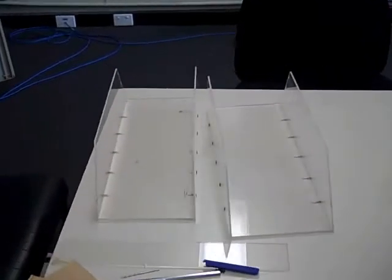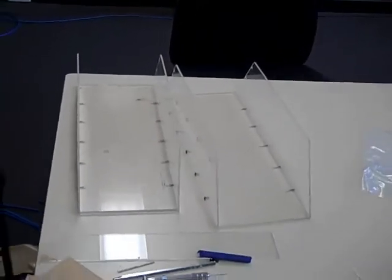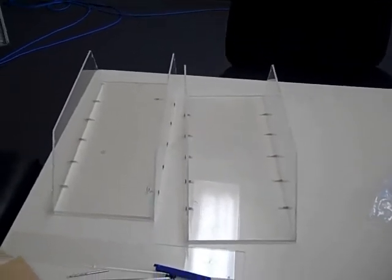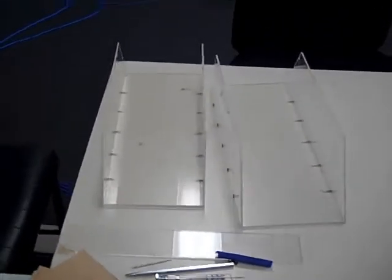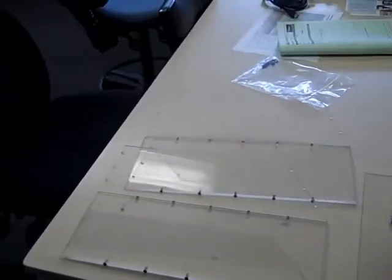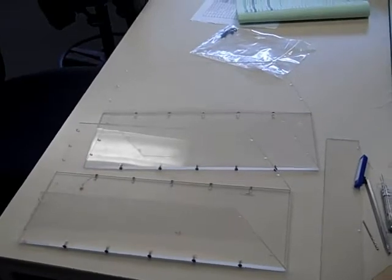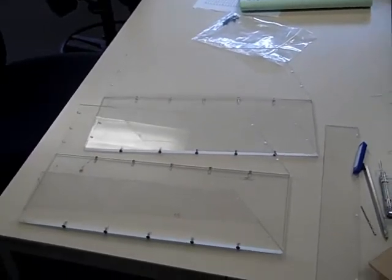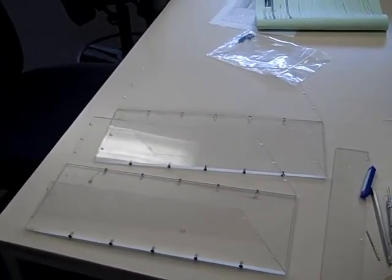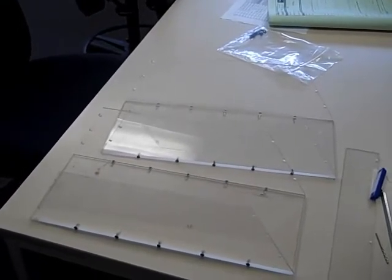I have made up two battery boxes in clear perspex to protect the battery both from the weather, and also to house the battery for when it's being shifted around by the g-forces. I made it out of clear perspex because the battery pack is going to be used for educational purposes, and we wanted to be able to show series-parallel design on a battery pack so that the students get an idea of what has to be done. The next thing I'm going to do is put the sides on it - it's going to have an open top so we can force air into it and keep them cool.